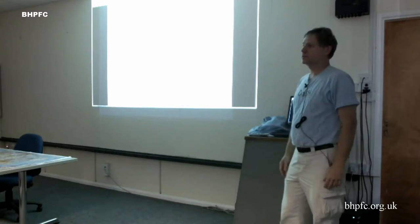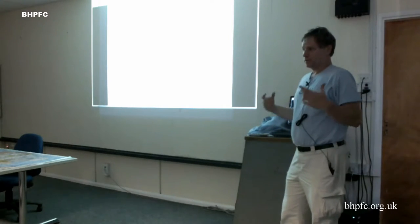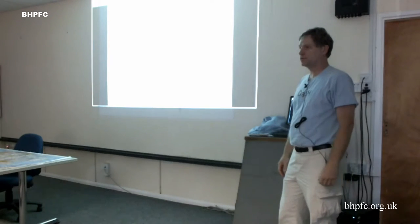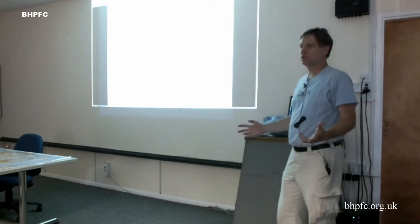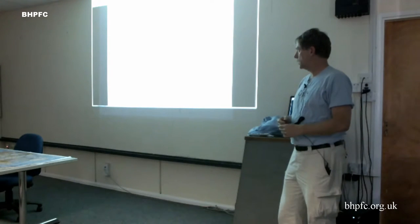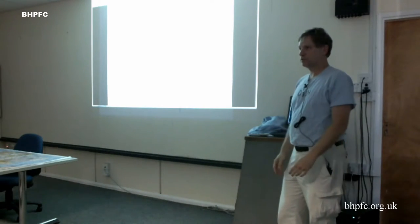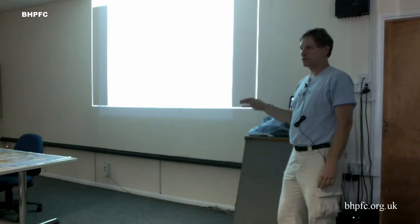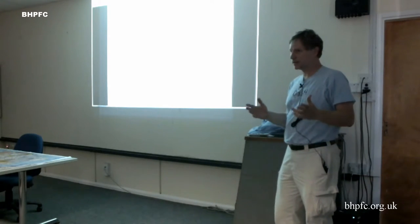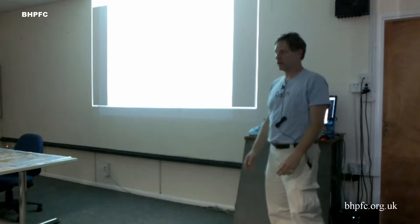I did some analysis, and because it's a very small wing area, short wingspan airplane, it flies fast. So having an unfit pilot has an even bigger effect than it would on some of the other airplanes that are flying successfully out here this week. For example, with a 75-kilogram pilot, roughly 600 watts would be required. And if you know anything about the human power curve, we're talking about 5 to 15 seconds that you can put that out.